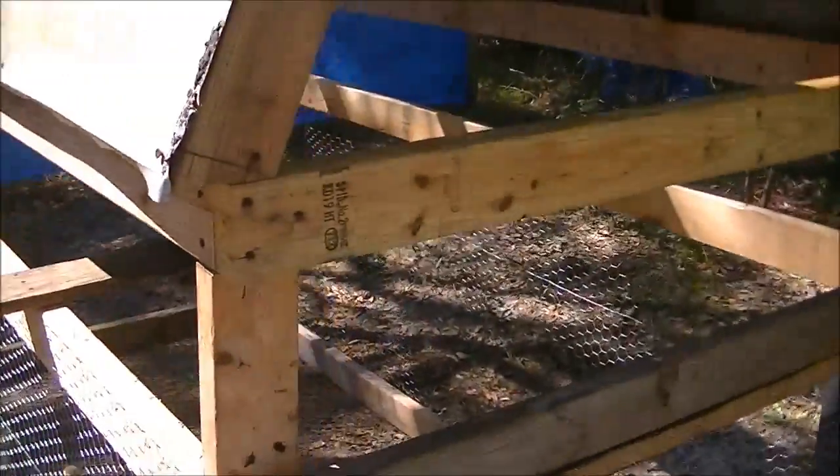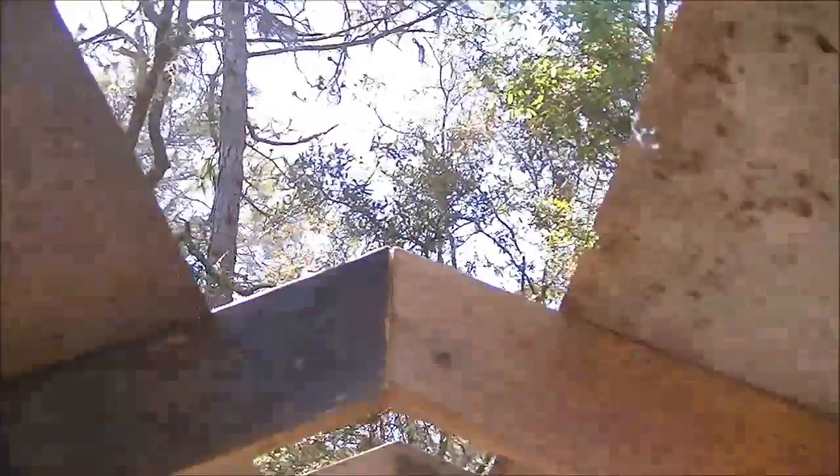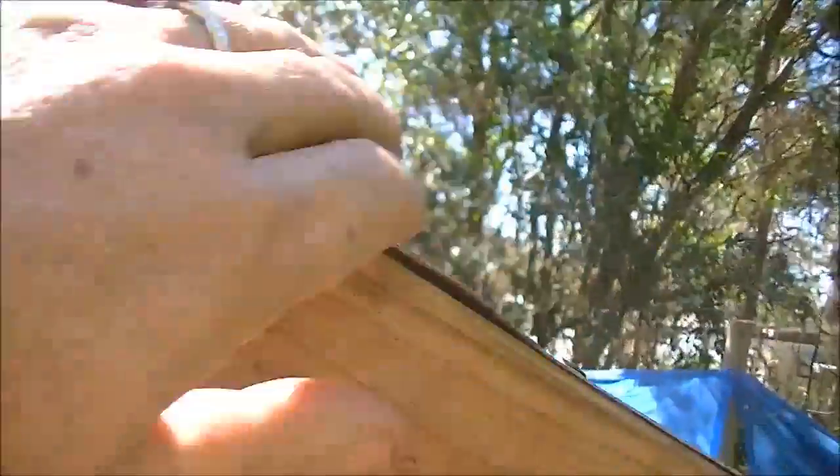Let me give you a little more detail about the design. I liked the barn-style roof and I had those pieces of aluminum and the lumber already here. As you can see there's a substantial hole up there — that's actually a good thing. We'll cover that with hardware cloth, put some one-by-twos across the top to hold the hardware cloth down, then put another piece of metal over that for good ventilation. Same with the eaves — we'll put hardware cloth there to keep them ventilated and keep pests out.